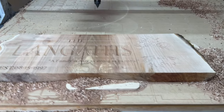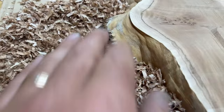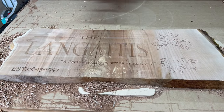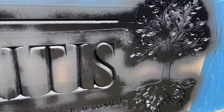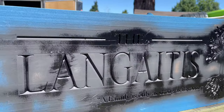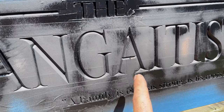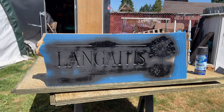This is just a beautiful piece of maple. There are burls in the end — so much character in this wood. Let's get it final sanded. Actually, we're going to paint it first. I'm going to go black on this and then we're going to final sand it. Why primer? Because it's sandable. Sometimes the problem comes out because of that little crack going through — you don't want to paint into the crack, otherwise that will remain black as well. Let's see how that comes out.